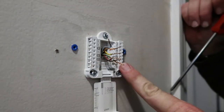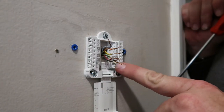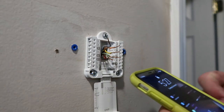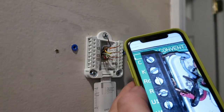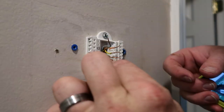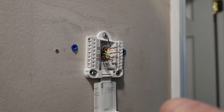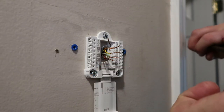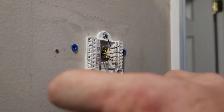Now here's where we'll start putting all of our wires back in. If you remember, the other one had a little jumper from R to RC. We'll go get that real quick — this is where that picture comes in handy. We can look and see what everything was in. As you go back to our picture, we got the R and RC jumped together. We're going to stick this in there. The little points are kind of wide, so I'm going to have to squeeze them together a little bit so it'll fit into those holes.